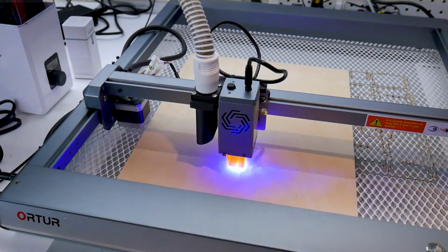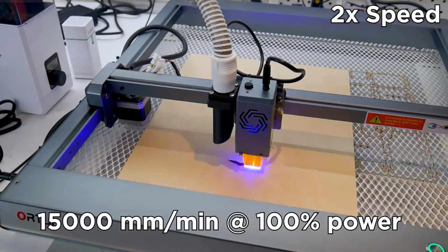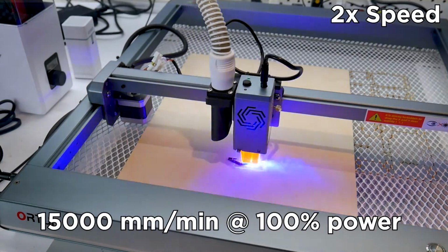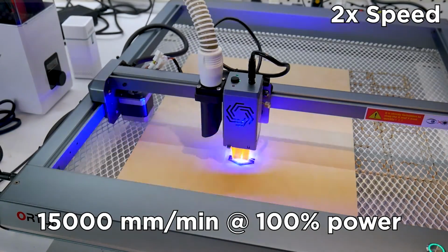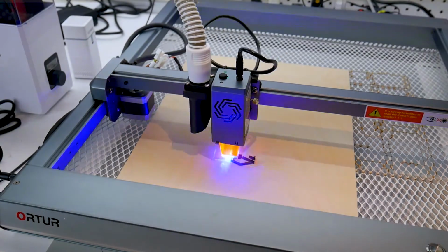This next panel has all of the support pieces to hold up the coffee pod roulette wheel, and the front piece itself has my logo engraved on the front of it. Now unfortunately, I kind of screwed up the position of my logo on the front support piece. When I imported the file into LaserGRBL, I didn't notice that I had a 3mm offset set in the X direction for the engraving procedure, and so my logo is off-center by about 3mm.